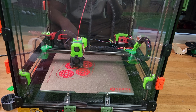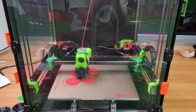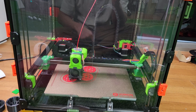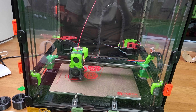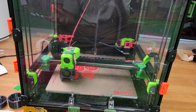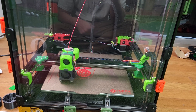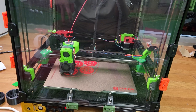If you're going to do PLA, I hear the fans aren't that great and the enclosure isn't that great for it — you might just leave it open. If you're going to go the PLA route, I might suggest another printer, but I don't print PLA. I just have no use for it because most of my applications need to stand up to UV rays or at least moderate temperatures. PLA just melts. So I usually print PETG, TPU, and now ABS.